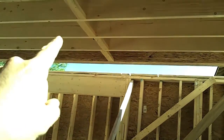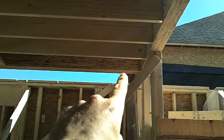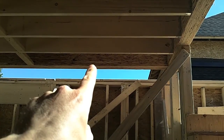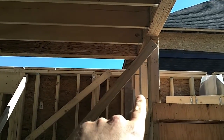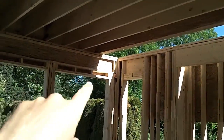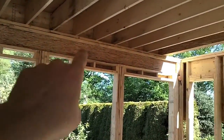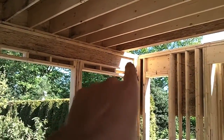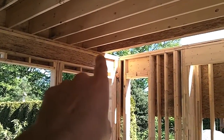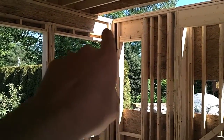Just the same way, the wall on the second floor and the roof on the second floor will be supported by that engineered beam. There's a reason why we used 2x12 here and a huge engineered — I think it's about a 16-inch beam here. When those beams land, they sit on that point there and that point over there. So when we sit a beam on top of a window like that, we have to use another beam below it. We have a point there caught by this point here, so that load comes to that point, which transfers over to that beam there, which transfers to that point. Those are what you call point loads.